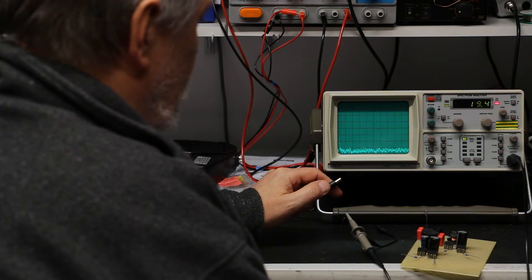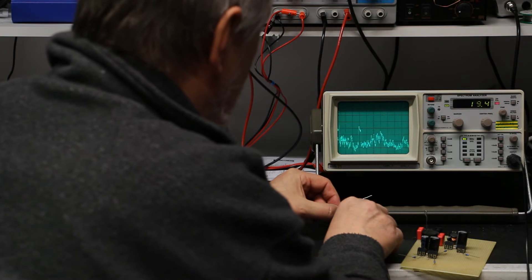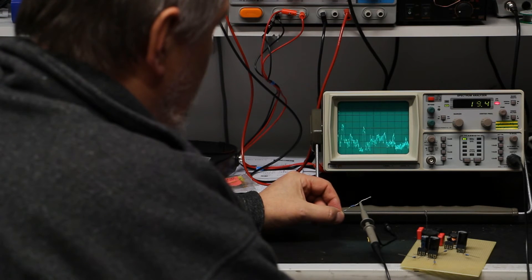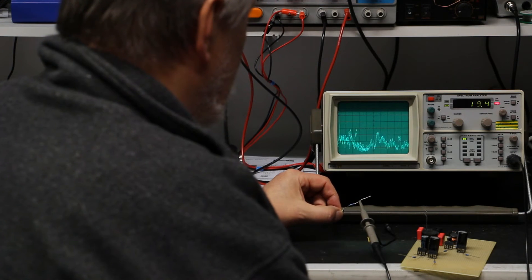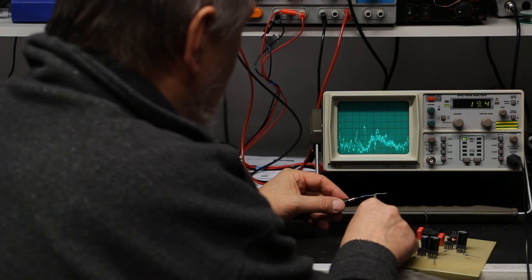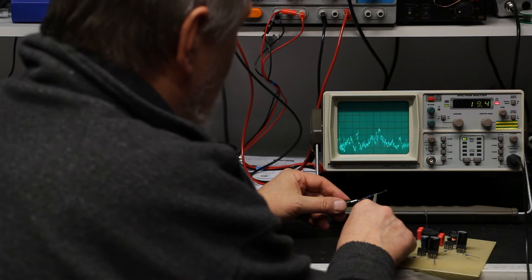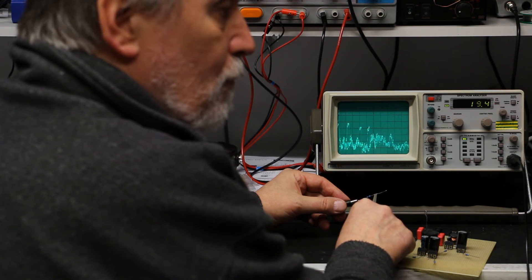Now let's see what happens if we connect the spectrum analyzer to the DC output from a simple cheap switch mode power supply. Please Burkhard, do the connection. Now we get the whole range of emissions from the switch mode power supply above the EMI or RFI emissions from ground, because we only connected the center pin of the probe to the switch mode power supply. It makes no difference whether we connect to the so-called ground or the DC output — the noise is the same.